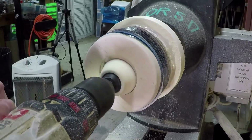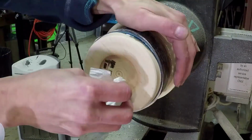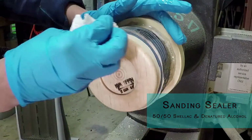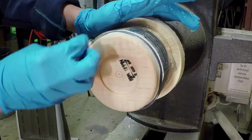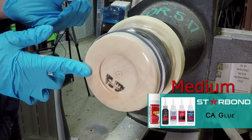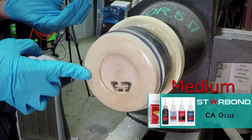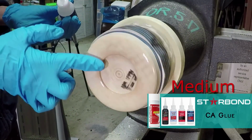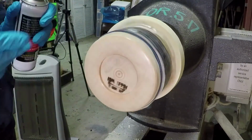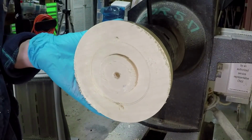And it's not like a horrible, huge gap or anything. It's just one of those things where it's there, so it drives you nuts. So that little gap, or it's just misaligned slightly because of my clamp slipping off. So just make sure if you're going to hollow out your piece like I did to save the material, that you pay extra attention to how you clamp it.